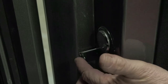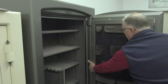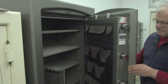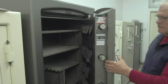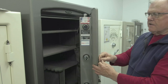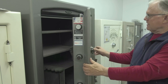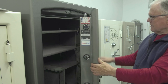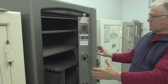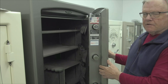There's a little detent button right here. You push that in with one hand, then pull down the hub with the other — the pins extend out. Now with the pins out, release your key, take your key out, and turn the dial to the left. Make sure the hub is all the way over before the lock will draw.